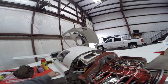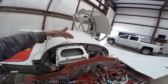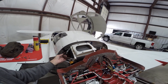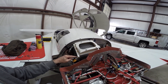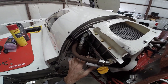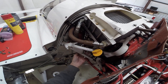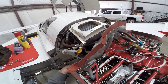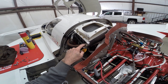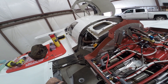Here's the manifold block I mentioned — just two bolts going through, holding it on and also holding the starter relay on the other side. There's a top-mount oil cooler with Aeroquip 466 AN8 fittings with 45-degree bends — no 90s — which improves oil flow. There's a kludged sensor mount using a couple of Adel clamps and an adapter — that's for the oil pressure sensor. When I change oil, I disconnect this and use a little aluminum channel to drain the oil out of the cooler. It's an 18-row cooler, quite a bit larger than what the plans call for.